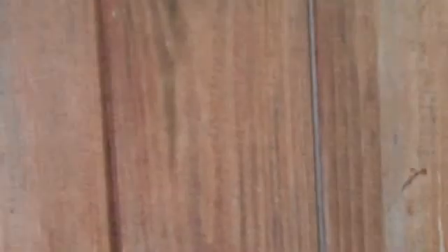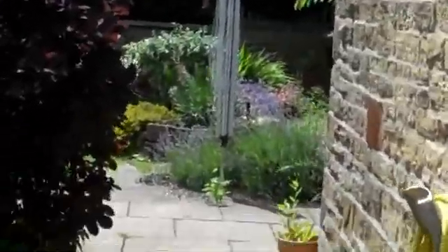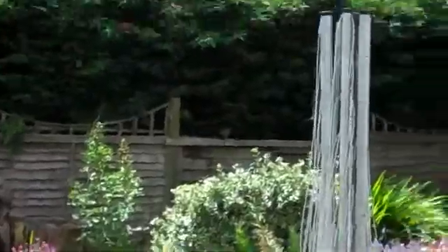If we now go around the back of the property, this house is constructed with a rendered rear elevation, rendered in sand cement. The builder decided he could use black ash mortar for that elevation, which would be cheaper. Perhaps the architect didn't want him to use black ash mortar on the other elevations. So this is a good opportunity to check ties in the same house, probably from the same batch, and see how they differ.